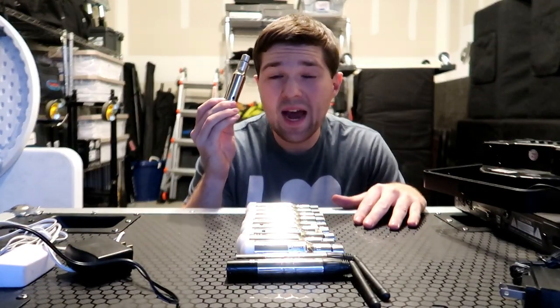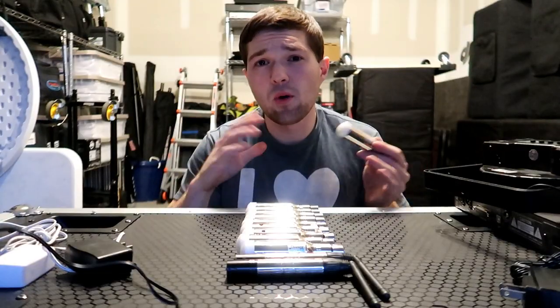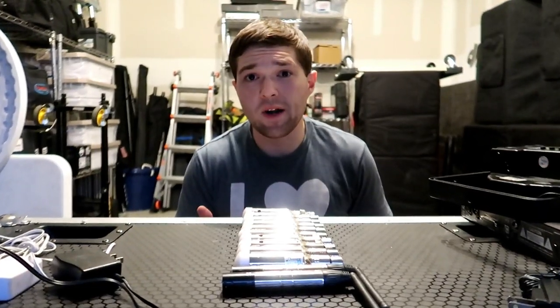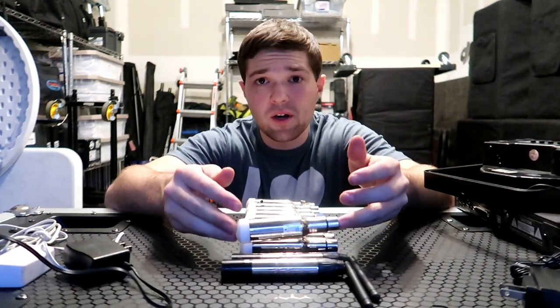The main reason for getting wireless DMX is to save on your setup time. When I first implemented these, I saved a whole entire hour on setup because of all the cabling you have to do with wired DMX. The main negative people mention is delay, but it's literally like 0.01 milliseconds — super hard to notice unless you're looking for it. For the mobile guys out there, you're never going to notice this delay.